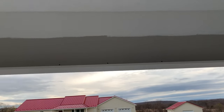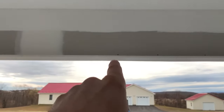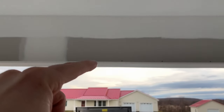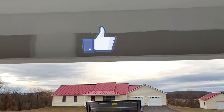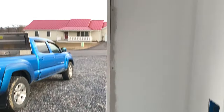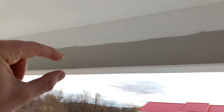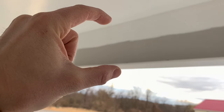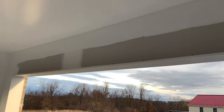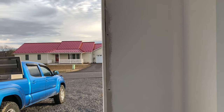The first thing I got to do is find the center of this door opening. I'm going to pull a tape — it looks like it's about right here — so I'm going to get a measurement from here to the top of the ceiling, and that's going to be my center block. Then I've got these side boards. I got them pre-cut and they're going to run up and stop about right here, and then I'll run a two-by-six right in between the blocking. I'll show you how to do all that.